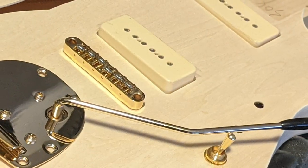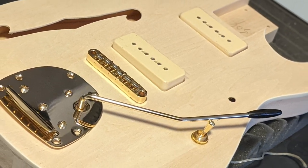I bought this switch originally for the kit guitar back there, with my dual P90 guitar. Unfortunately, this switch doesn't have enough contacts on it to do everything I wanted to do with that guitar. So I needed to get the next version up, which has a lot more contacts. That way I can do in and out of phase. There's no coil splitting because they're two P90s, they're single coil pickups. But there's series, parallel, in and out of phase, all that stuff I can do with the other switch for that dual P90 guitar. But this switch is going to serve me well anyway with my trusty old PRS